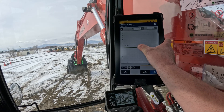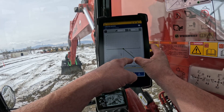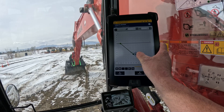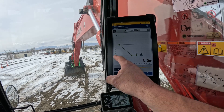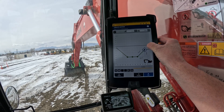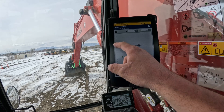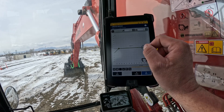Let's do a V-ditch. Let's grab that and bring it down — about five feet down and five feet over, so about 100% slope. To create a V-ditch, we'll drag it over about two feet and then another two feet. You can use the grid system here as a reference, or you can key it in. Now we'll pull it back up to about 100% and come back up to that same line, dragging it over until it mirrors what's on the other side. Then we'll create a flat top table — about 10 feet.